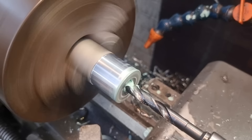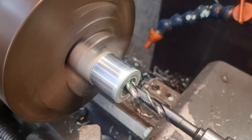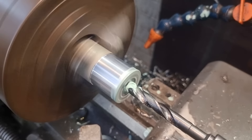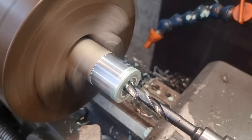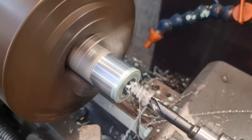By accident I accidentally machined the OD down to just what we need. Now this one is 31mm, so I'm going to go about 35-36mm deep and then open it out to 19mm.